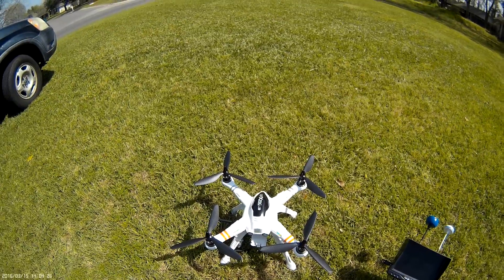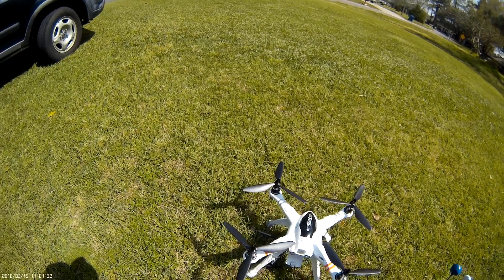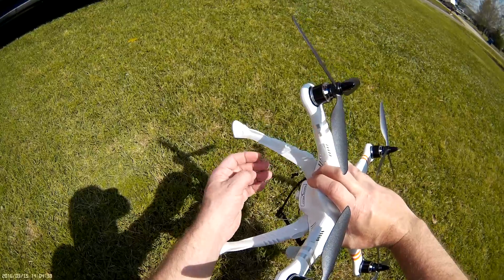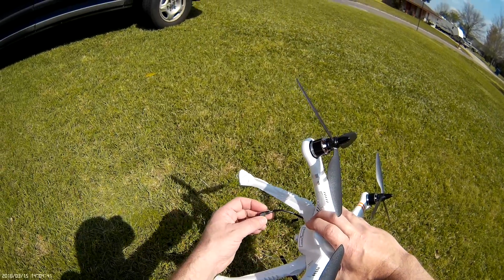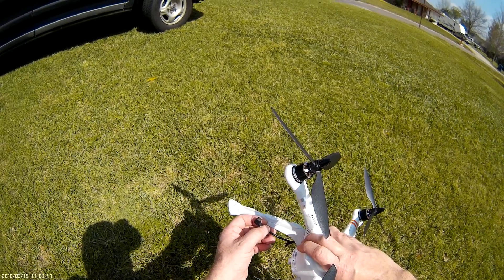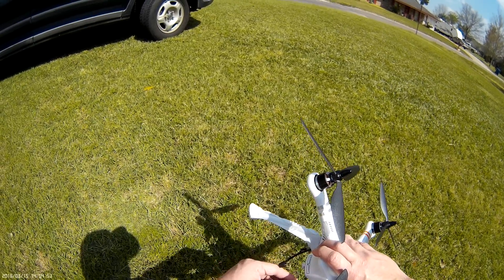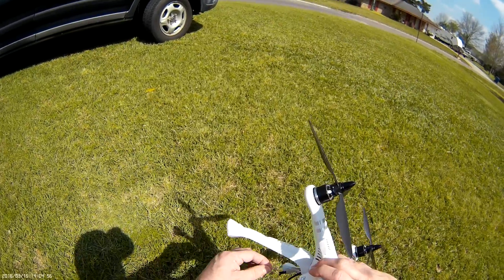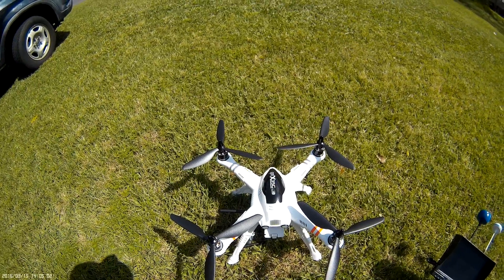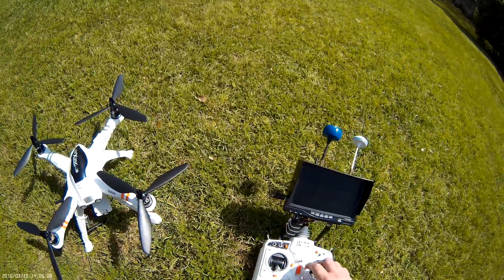VTX and OSD are working. I don't have an SJ cam with video out — I have one but it doesn't have TV out, so I can't test that. But I did add the cable for the SJ cam. I wired this cable up to do video and power the SJ cam at 5 volts, so it'll charge the battery in the SJ cam and you won't be running your battery down. That's going to be it for Tom Kuhl's X350. I'm going to go ahead and tear it down, get it boxed up and ready to send to him. Thanks for watching.